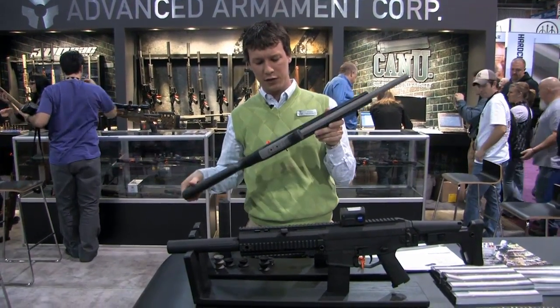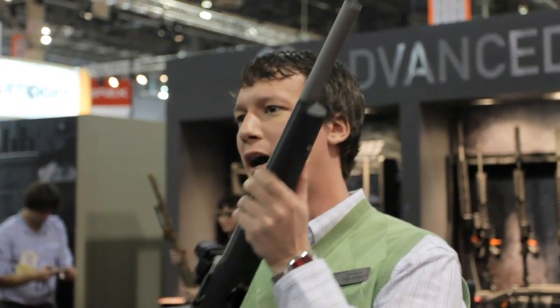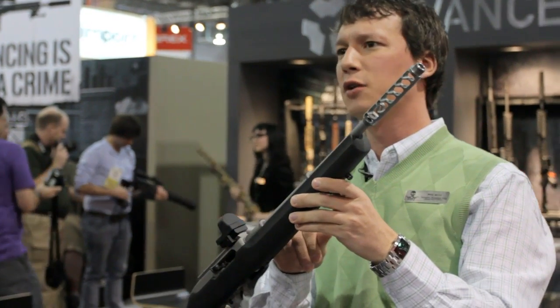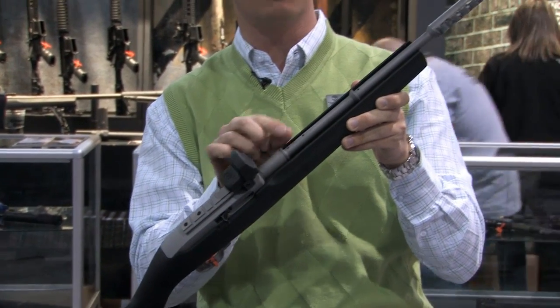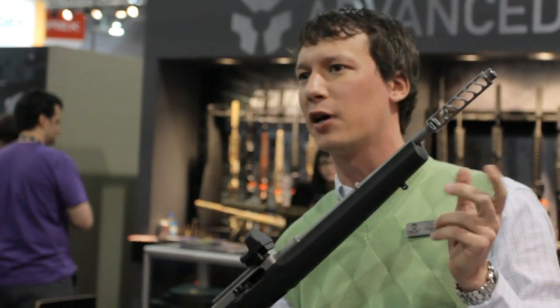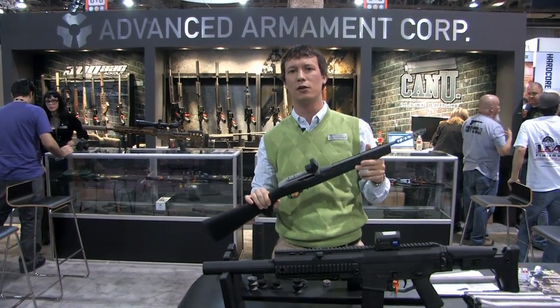This is not available yet, but this looks like a regular Ruger 10/22 in a Hogue stock — but we've actually built a silencer into the barrel. Our integral silencer is a little different. Other designs build a silencer that comes out in the front to keep it overall 16 inches. Instead, we built the silencer into the barrel — it starts life as a heavier barrel, we turn it down, put ports in here. You can see the ports. We vent into this coaxial area, and we build a little monolithic core on the end. This is only one tax stamp — it doesn't come off, so it's not an SBR and a silencer, it's just a silencer. And you can get down here and clean the ports, which you can't do with other setups where the silencer comes out in the front.